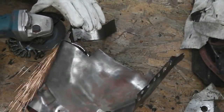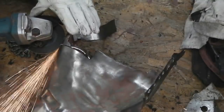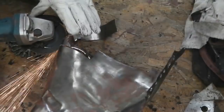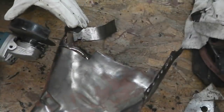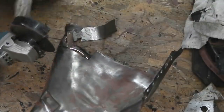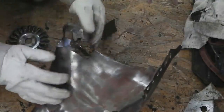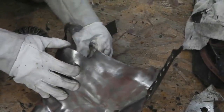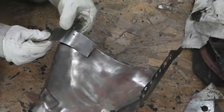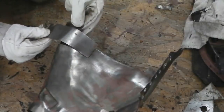You do get used to using it, you get confident with the 1mm, but there'll always be the day when you can slip. You don't get complacent with them. But they are good for just coming in freehand. People use tin snips as well, not for this job, but for cutting metal. Tin snips are good, aviation snips are good, left and right handed aviation snips you need when you're doing real precision cutouts. This is just freehand, freeform.